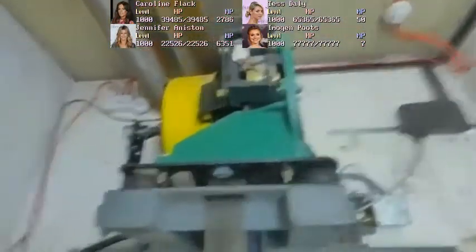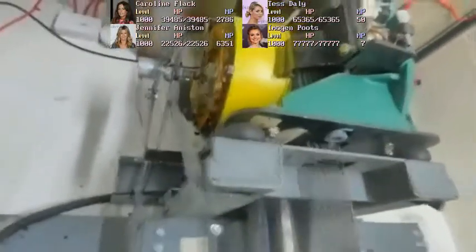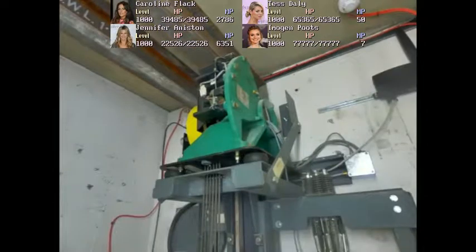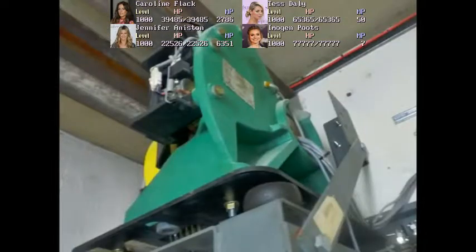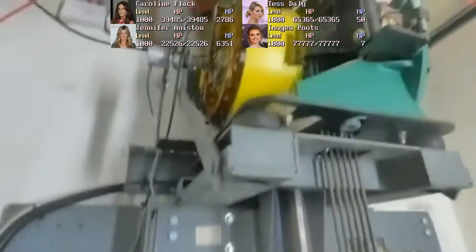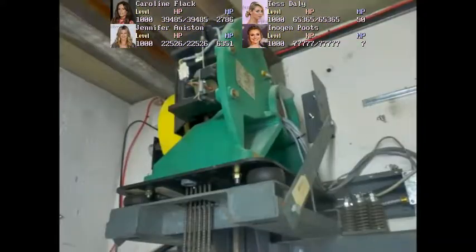Here is the motor. Wow, just look at that. That's actually quite a different design of motor to a lot of other MRLs. Some of them have very small motors like the Gen 2 and the Schindler, or alternatively a flat motor down the side of the shaft. This actually looks like a more normal sort of lift motor. It's just weird that it's got this little beam hanging off the main beam at the top — that is an odd design. This is actually more like an MR-designed motor rather than an MRL, since the motor is sitting on the beam rather than suspended on it. So it's got a beam that the motor sits on, attached up to the main beam. That's quite a bit of metalwork — I wouldn't say that's the most logical design.